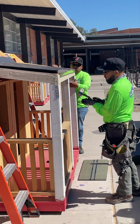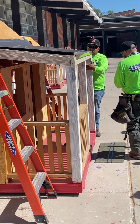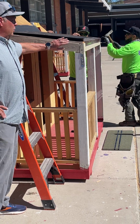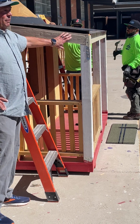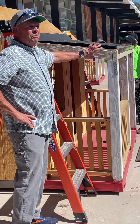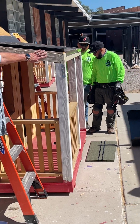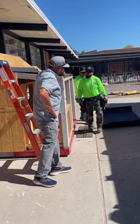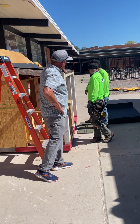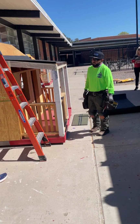So that's the primary line of, I call it defense. Again, if the fascia is subjected to rain, sun, eventually, and I'm sure you've seen it if you look at any home around town with the Arizona sun, fascia is wood, and it just gets beat up and it rots. And so the metal, you can see it, it's got a piece that cuts out at a 45. So as water comes down, it wicks it out and away from the fascia.